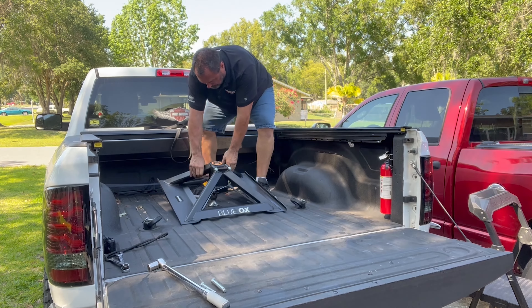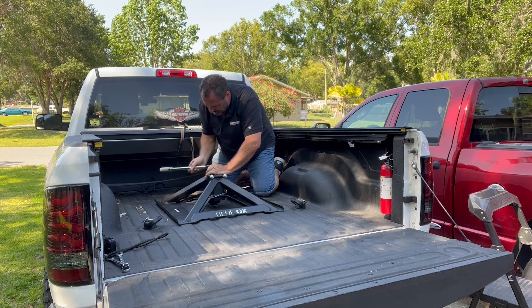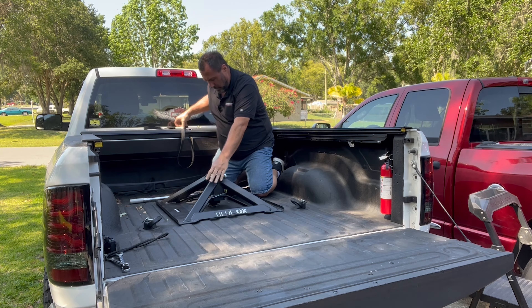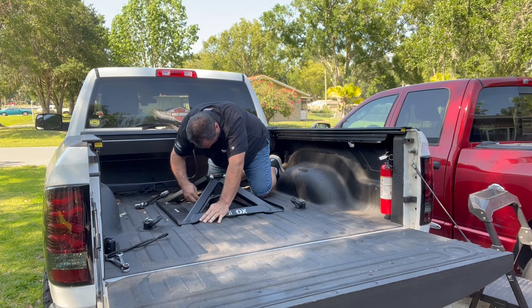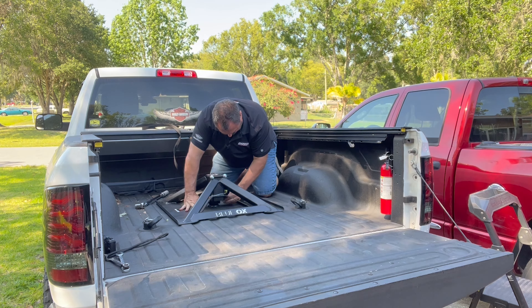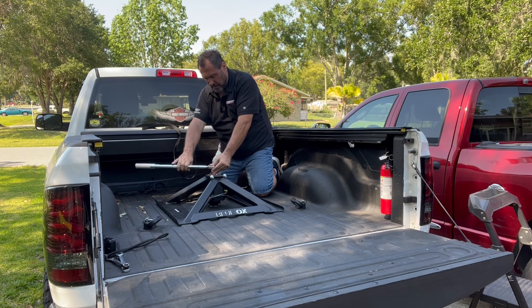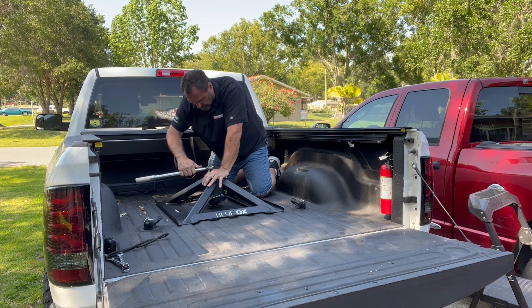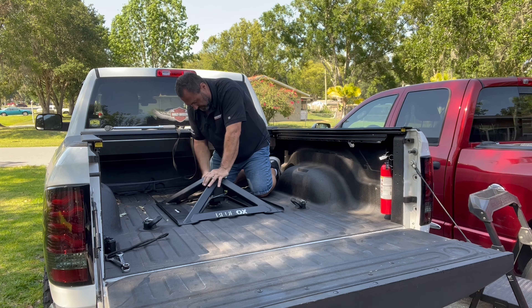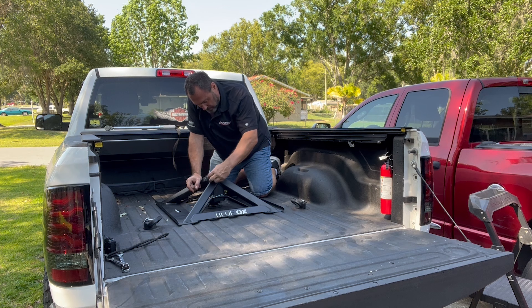And up and over — that's the hard part. You've got to go down a little more. I should be able to get my pins put in now. There we go. The lock pin's on it. Then tighten this up — 45 foot pounds. There's that. Now on the back side here, you can't really see it in the video, there's a locking stud. Send him in, hit the jam nut and tighten him up. We'll get to that later. But first thing we need to do, open this up a little bit so we can put our head unit on.